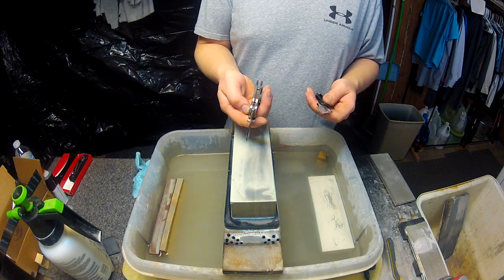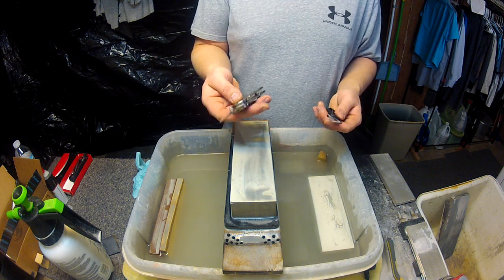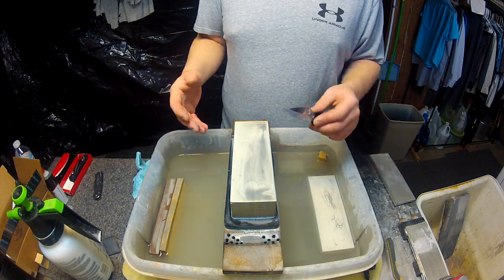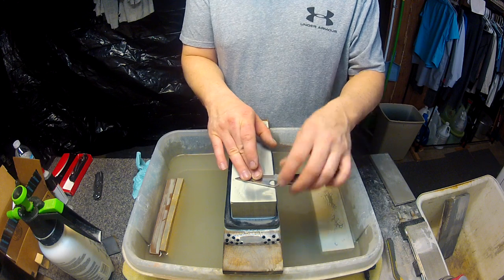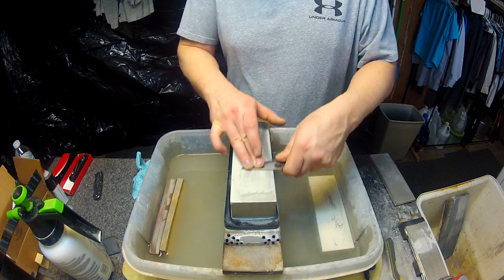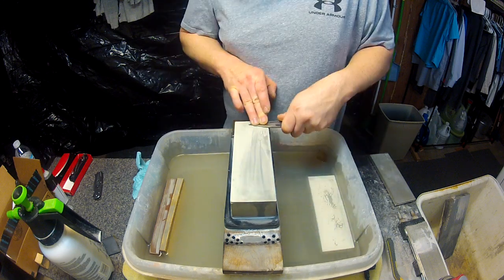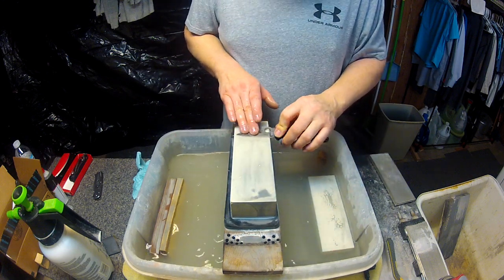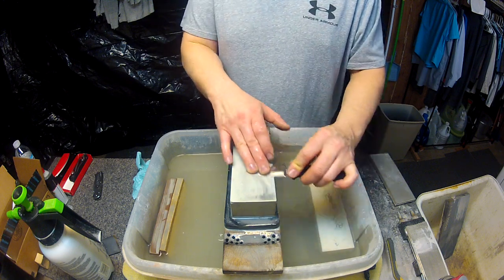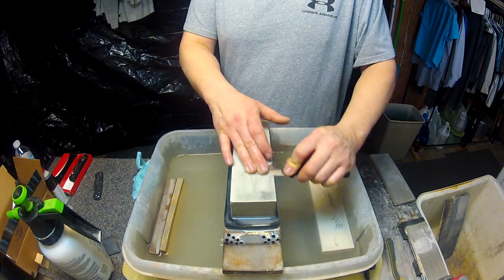This Three Sisters forged beast is kind of a great example of that. It's just an overly built knife — I mean, it's cool, but it's not a cutting tool in my opinion. It doesn't have a thin enough bevel to be a cutting tool. I'm going to do a little review on that, the customer requested. You can make them usable, you can make them sharp, but without having a good secondary bevel — which is the side of the blade — without having a good geometry to that secondary bevel, there's really not much you can do for it.